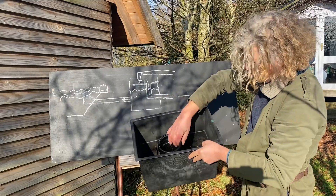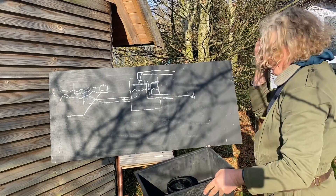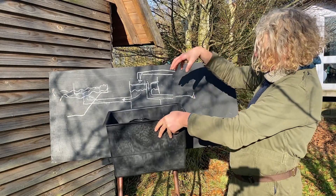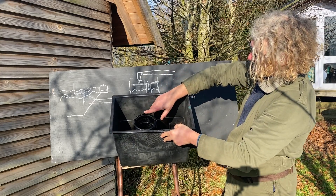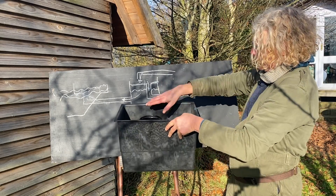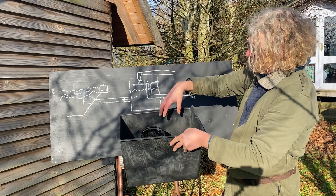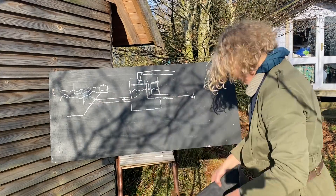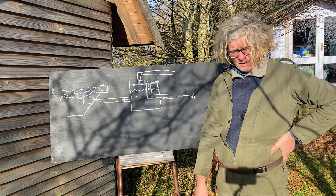So here's the water level. Then we have our rainwater pipe — which drops in here — and if the water level rises above the elbow, it drops down and out of the exit drain. If it's less than that, any water that comes in from your roof will go into the pond. Clear as mud — hope it helps!